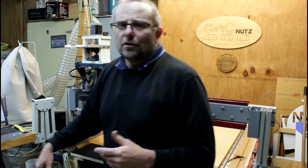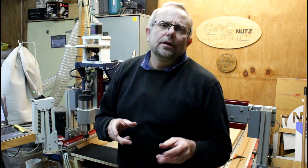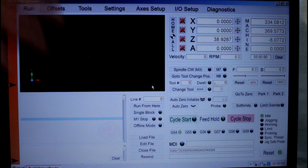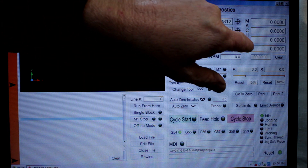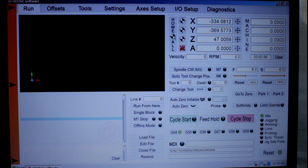I'll just take it out of emergency stop. Now we are at the position where we need to set our machine coordinates X, Y and Z to zero. For those of you not familiar with this particular screen set, this is Jerry's 2017 screen set for UCCNC. I'm using this one because I like it, but also because it has machine coordinates and working coordinates all on the same screen. So I'm going to push the home all key. Even though my machine does not have those limit switches, it understands what I want it to do. The machine coordinates have now all been set to zero, and I'm also going to set the working coordinates to zero as well.